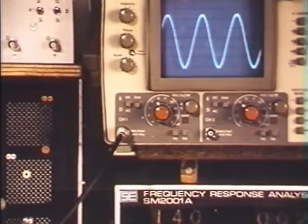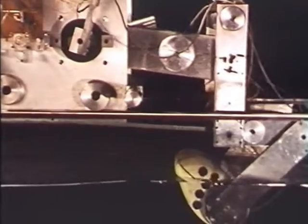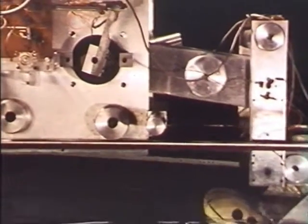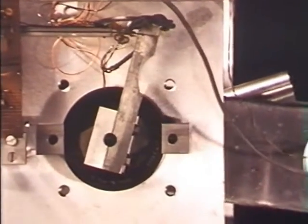Now that's a rather boring picture of an oscilloscope. It means that we're about to drive the pitch-heave-surge rig. We're driving it in heave and it's radiating waves differently on each side, and we make useful measurements of the size of the waves made by moving the model.